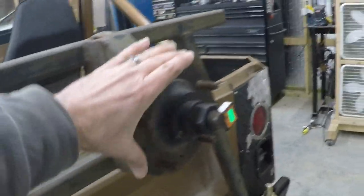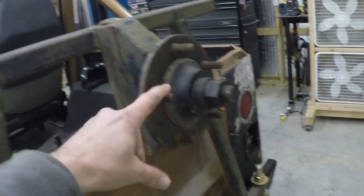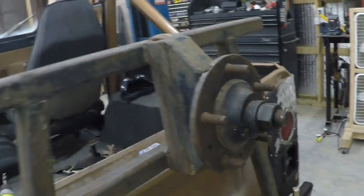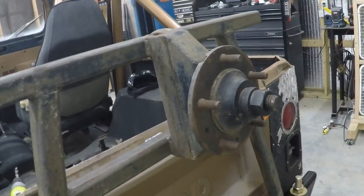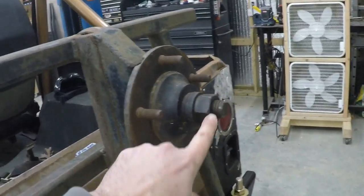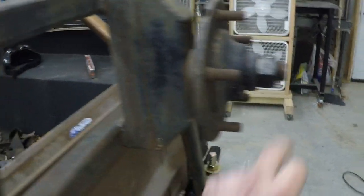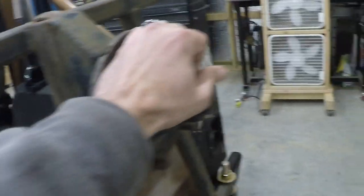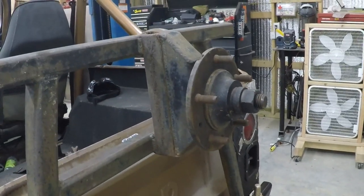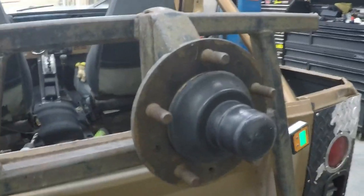The part that the tire mounts to is actually just part of a two-piece rear axle — it's just the hub off a two-piece rear axle, an AMC 20 outer hub. If you get one of these Jeeps and you switch to one-piece axles in the rear, you'll have one of these laying around. It's basically just a bolt welded inside there, ran out with the nut on it. It's pretty sturdy — it's been there for years and hasn't ever gone anywhere. If you have these little caps on your axles, you can hide that bolt and it gives it kind of a clean look.